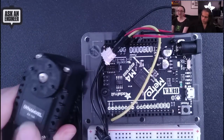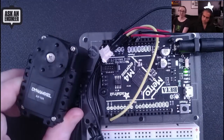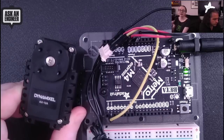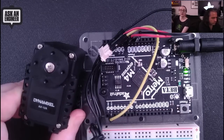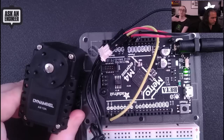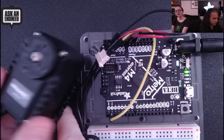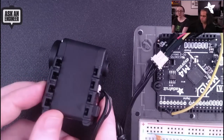You can send commands, trigger, set speed, and tell it which way to turn. So if I power this up, you'll see I'm telling it to turn to the right really fast and then slowly to the left. You give it the speed — you don't have to worry about calibration, it's always going to be the same from motor to motor. You tell it the speed you want and how long you want it to go, or you can give it a goal position. We'll probably carry more Dynamixel type stuff, starting with the most popular, simplest motor.